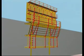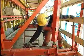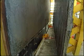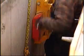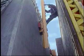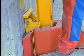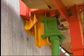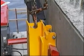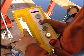The finishing platform is then connected. Here on site, the second lift begins with removal of the formwork ties. The formwork is then retracted. The climbing shoes are bolted to the anchors. The climbing rail is inserted from above with the crane. The pivoting bearing arm engages to secure the climbing rail. Climbing now takes place for the first time, from the second pour to the third.